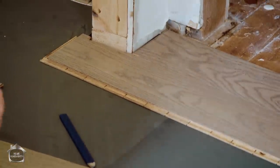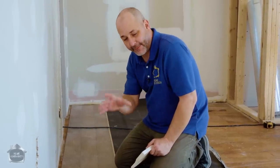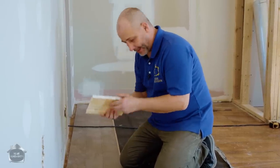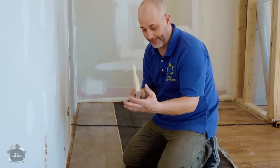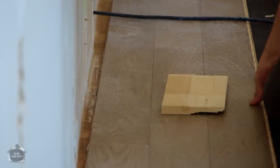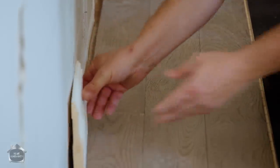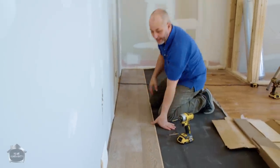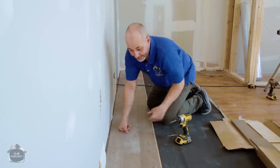We're going to be installing a door jamb — that's part of the beauty of DIY flooring: you put the flooring down before all your doors and everything looks great when you're done. One of the secrets to success: get the first three rows done, then take a piece of baseboard and slide it along the wall. If there's a gap, adjust your floor until every angle is covered by the baseboard.